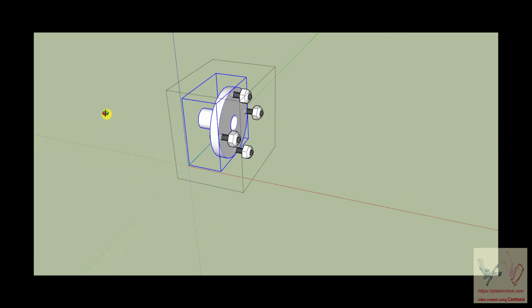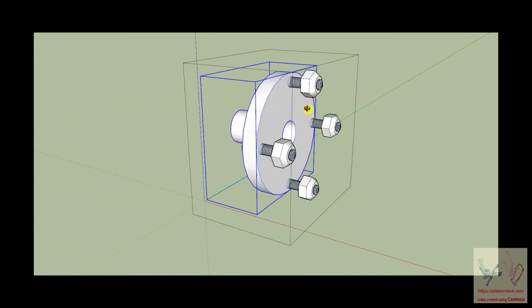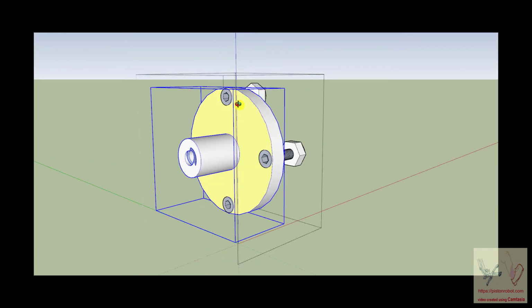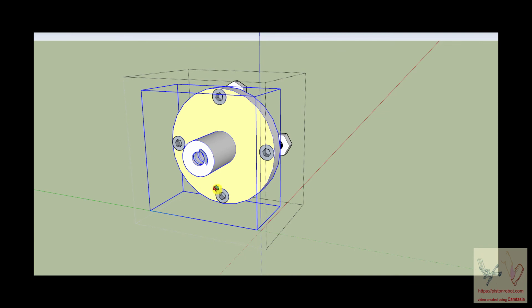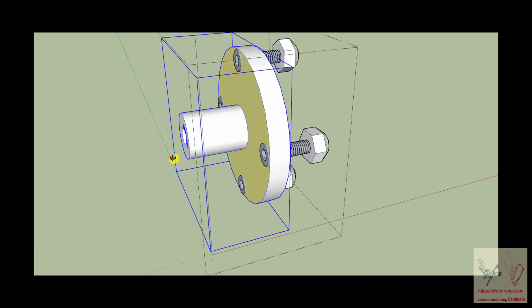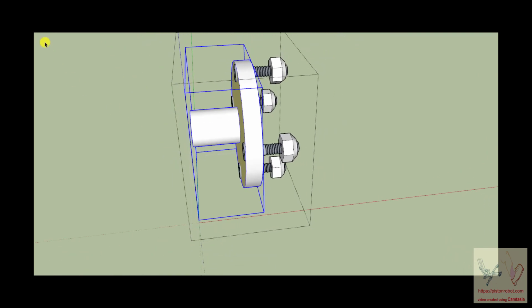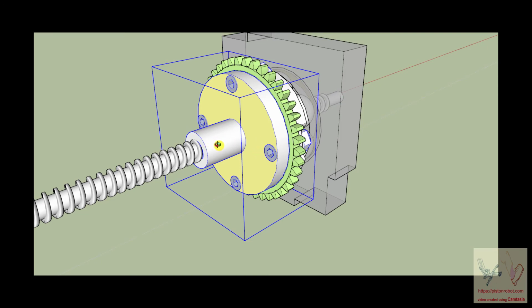the one that I made as the real deal, I actually have the ball nut as an integral part of this metal flange with holes in it for nuts and bolts, where this piece of metal is brought into being a ball nut. And I have a little hesitation because I'm not quite sure if that's easy or hard or expensive or not expensive. It doesn't seem like it would be expensive, but I don't know that for sure. But it looks nice, and it's small, and it's a small number of parts. So this is an integrated ball nut that is made of metal. I think the ball nut has to be out of metal. I'm trying to make as much of this out of plastic as I can. This probably has to be metal.